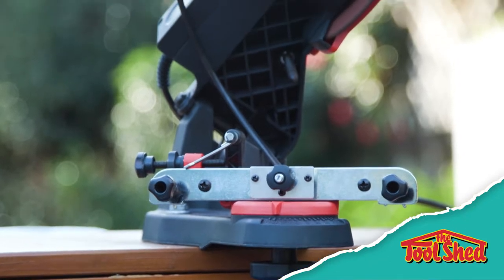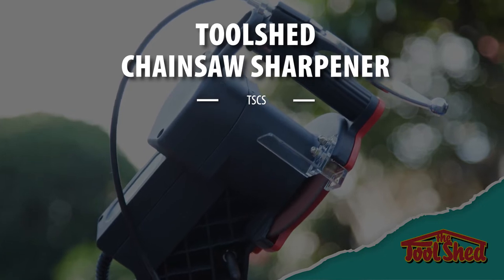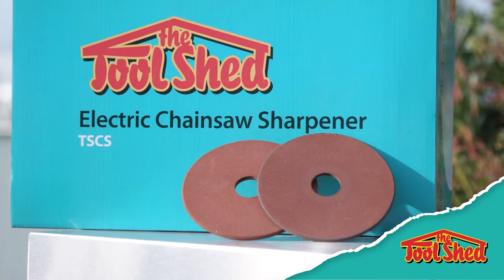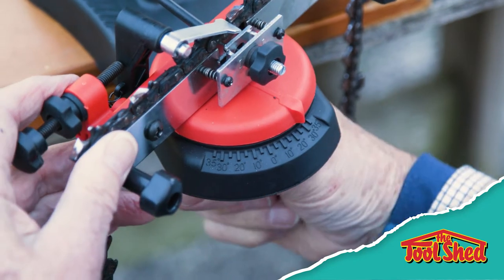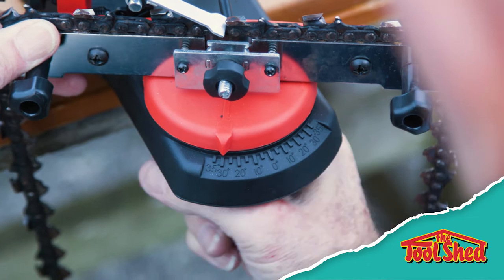Remove the hassle of sharpening your chainsaw chain with a file. Let the ToolShed electric chainsaw sharpener do all the work. Supplied with 3.2 and 4.5mm grinding discs and with adjustments of up to 35 degrees left and right, this sharpener is suitable for chains with a 1/4 inch and 3/8 pitch.